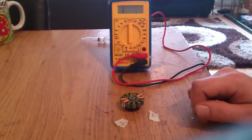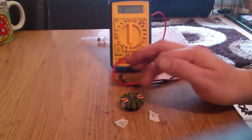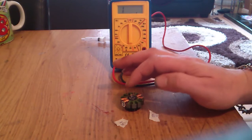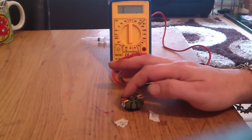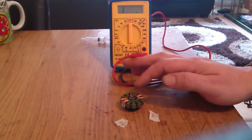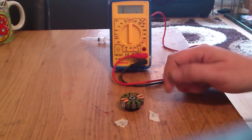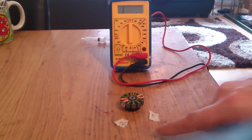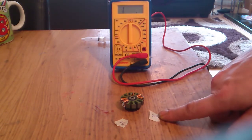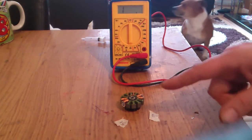Okay, so there's the motor wound with the first phase, started between 1 and 2, 2 clockwise, 1 anti-clockwise, went opposite to 7, 7 clockwise, 8 anti-clockwise, and I've now marked S1 for start, E1 for end. So that's all you do 3 times over.